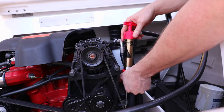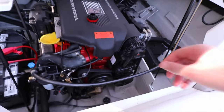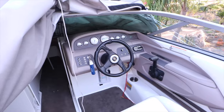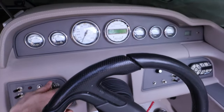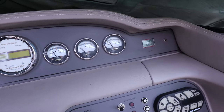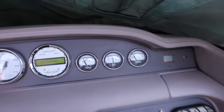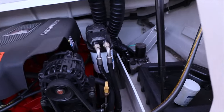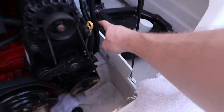I'm going to take this off and we'll fill it up now. We added oil in through here. We're going to go ahead and start the engine again and then check the oil level. We put a total of 5 quarts in. We're going to check for leaks and also make sure that we have oil pressure when we start it. All told it took 5 quarts to fill that up to the max line on the dipstick.